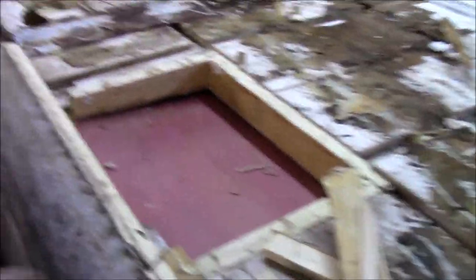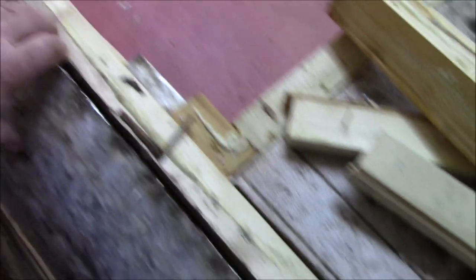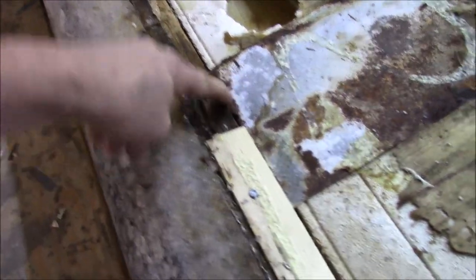We investigated this skylight frame — it's just kind of glued in there. Nothing seems to be properly secured; maybe it's stapled, but we see some staples. We're going to reframe it so it's tighter and the way it should be. It's also not at its proper elevation — you can see it ramps up a bit. We're going to get that squared away so everything is seated right, because it's not even with the foam. There's way too much of a gap there compared to where it needs to be, and we've got to replace all that framing.